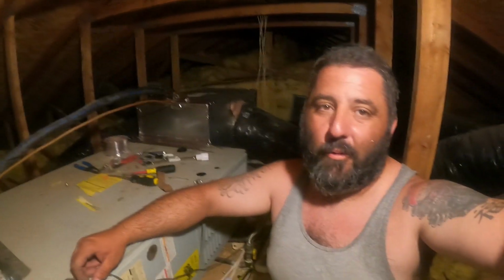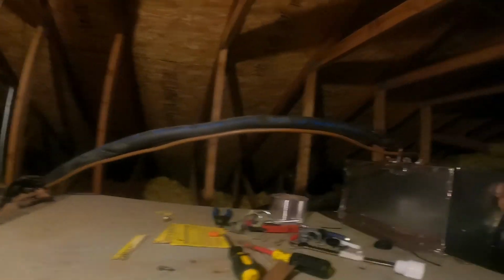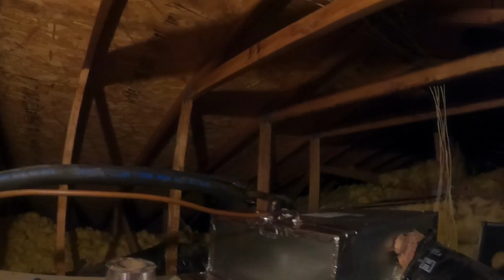All right, folks, we're all done. So about 11-12 hours. Actually about 7 to 8 hours of work max, maybe 6. I can only work 20 minutes at a time. I have to get out of here or else I could die. So we got the new coil in, hooked up all the ductwork, sealed everything, good to go. I got to wrap the expansion valve, and we're all done. So that's how you put in an air conditioner.